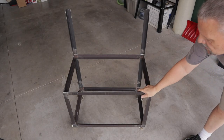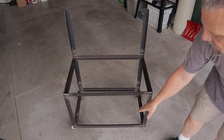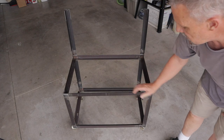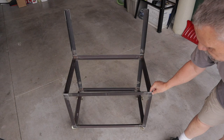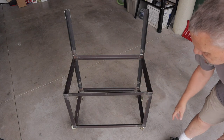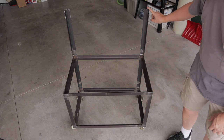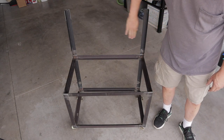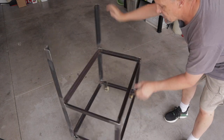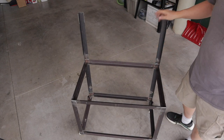So as you can see, this is how the framework came out once I got it all welded together. Basically, I just made two trays with some of the smaller angle iron off the recycled bed frames and then four corner posts, and welded the shelf frame to the corner posts. I'll put all the dimensions in the description if you're interested. These were 18 inches and these were about 35 inches, because I'm going to put a board across the top here and make kind of a back shelf to this thing. And I've got the casters on the bottom and I'll show you a close-up of how I did that.